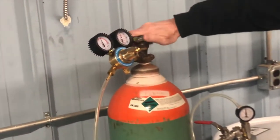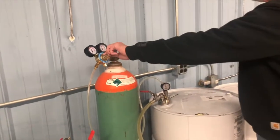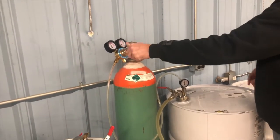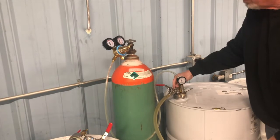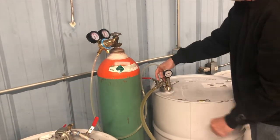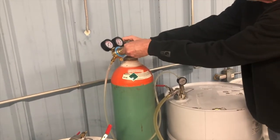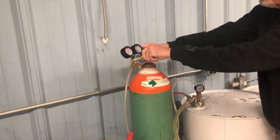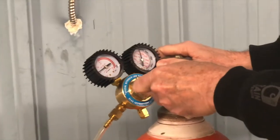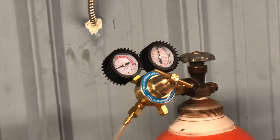That's the fail-safe system we use for preventing any accidental over-pressurizing of the drum during storage. I'll reset this now to the 7 psi that we need for storing our isopentane so we don't lose any.